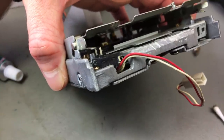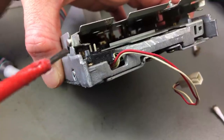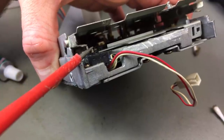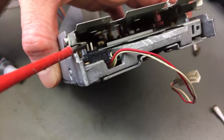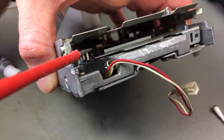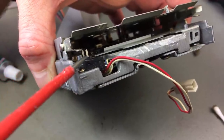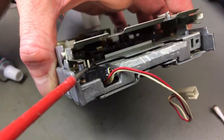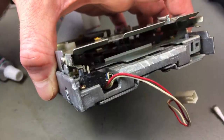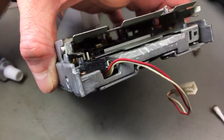So here's an interesting bit I learned about these drives a while back, which might be helpful to some. The older versions often have little mechanical switches to determine if a disc is inserted, or if it's write protected. These are just little rods that close the connection mechanically. So if these are stuck or broken, you often get disc drives that don't read discs or have intermittent read-write errors or stuff like that. Had that on a couple of old Amiga drives in particular.